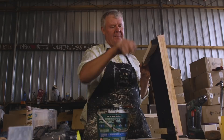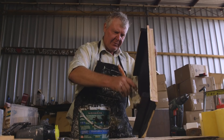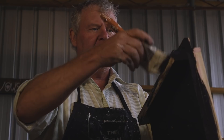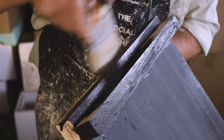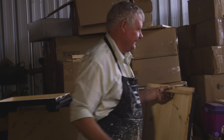So we're going to put a little bit more of the black muck on these bottom legs and on that back edge, then we'll sit it out somewhere to dry off a bit. I like the way it soaks into the wood, because paint will just sit on the top and doesn't really soak in properly, whereas this stuff seems to just soak right into it. I reckon it's good stuff but you can always make up your own mind. We'll paint this top bit with some other paint and then we'll be done. So that's the bases put together.